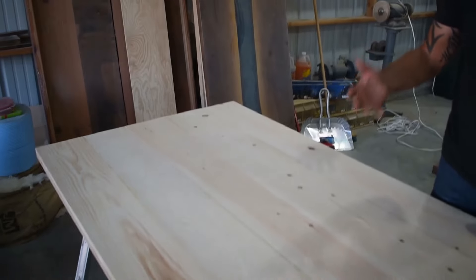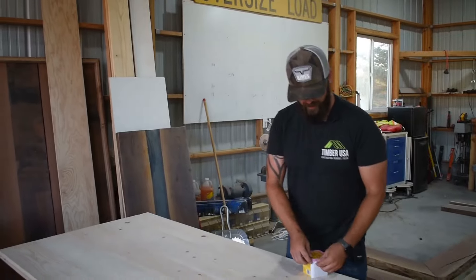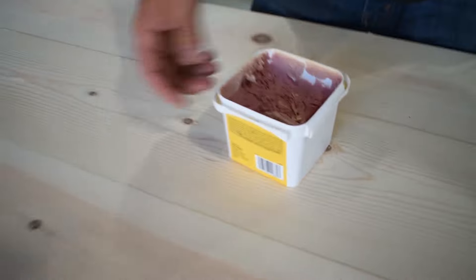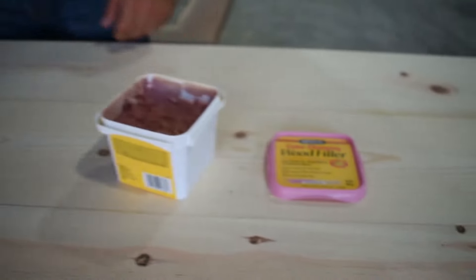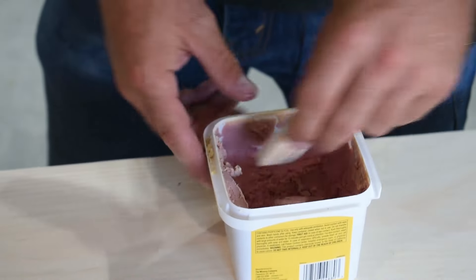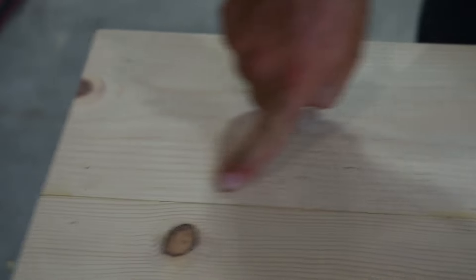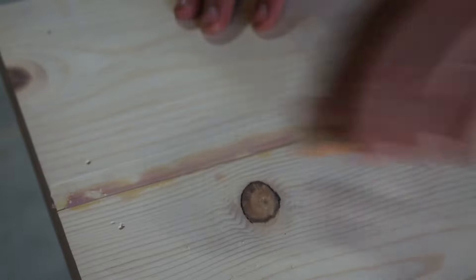So if you're building a wood tabletop like this, oftentimes the wood's going to move a little bit if it's fresh out of the store. But if you buy wood putty like this — this is from Minwax, color-changing wood filler — I do like it. It comes pink, but once it dries it changes, and I'll show you how that works. To spread it out, I just cut off a little piece of 2x4 like that. Get some on the end here — you can see the crack in between these boards — and I'm going to apply the putty like this. What I like to do after is take my hand and go back and forth over it, smoothing that out.